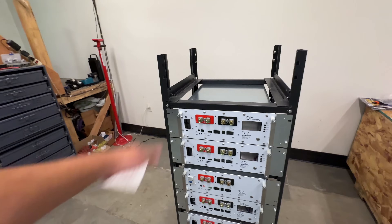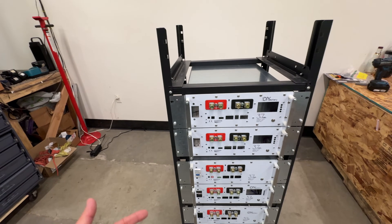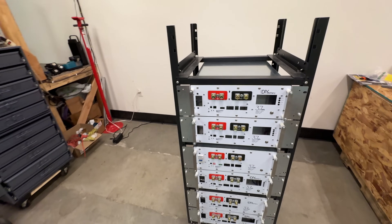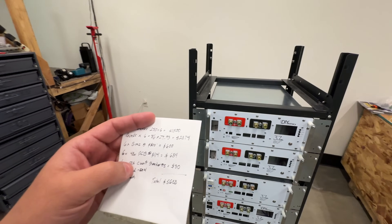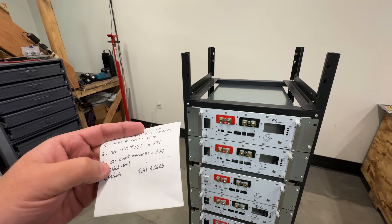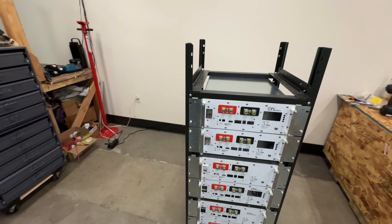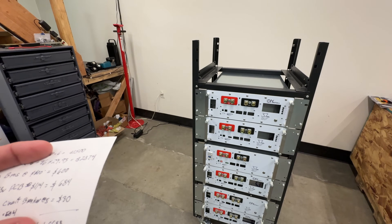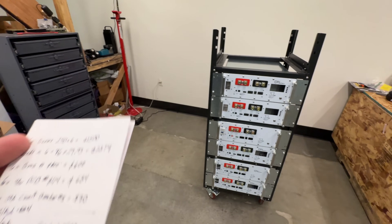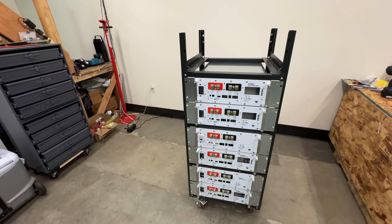Not including the PCBs gives you flexibility to build the battery at your preferred voltage — I'm surprised how many people want different voltages in their rack battery system. The PCBs would come to $684. Then you need six 150-amp circuit breakers, which are about $5 each — so about $30. The total comes to $5,622 for 22.2 kilowatt hours, which breaks down to about $256 per kilowatt hour.